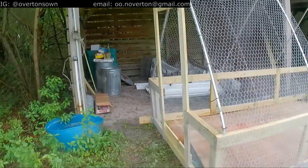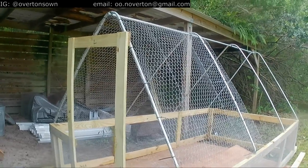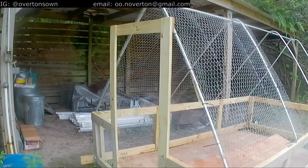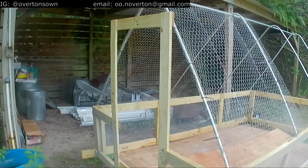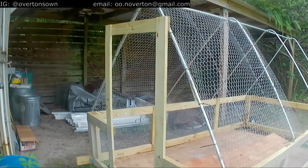I'll still take the two screws and drill in, but I won't have to worry about a second set of hands or holding the conduit while trying to drill into a round surface. It also keeps that edge flush, so when I'm mounting the hardware cloth or chicken wire I don't have to fuss with irregular shapes from the conduit. Progress made — I've got one part of the chicken wire secured; that's the front side of the door. The door was highly suggested to do last, because the frame is going to shift and twist as you move it into place.